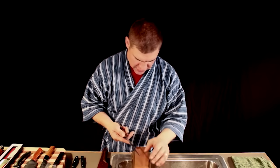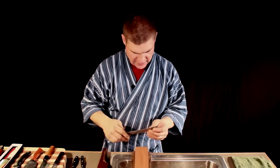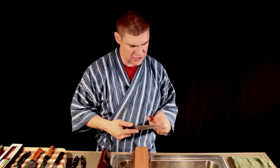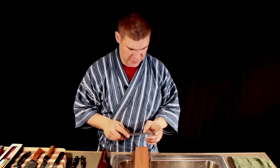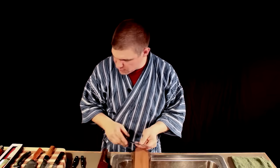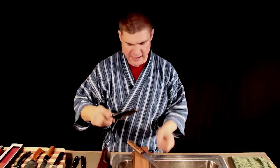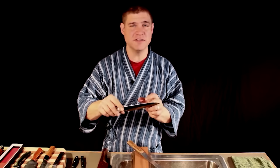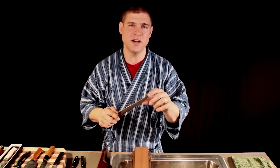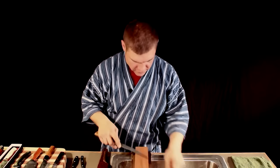Well, for one, this is kind of a carving knife. It's like an 8-inch carving knife. You could carve turkey and things like that with this. And one area that presents a kind of a challenge is this radius or curve in the tip here. So actually, for most knives with kind of straight edges, if I'm mentally dividing that blade up into 3 or 4 or even sometimes 5 sections, when you have a radius like this, you also start to subdivide that up into 4 or 5 sections as well.